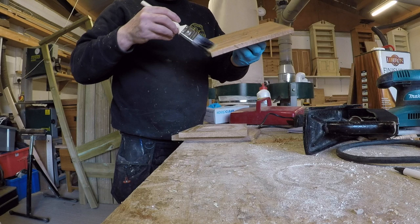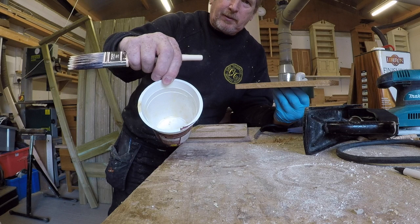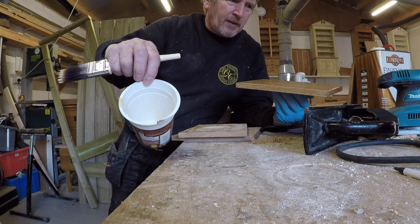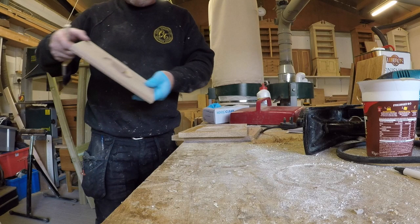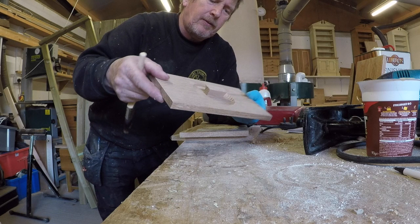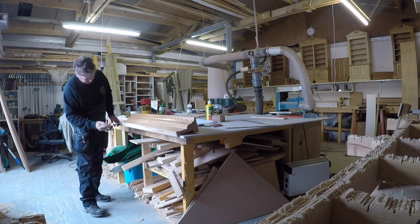This oil almost looks like it's on its last legs. It's congealed. Furniture oil goes like that, and when it starts to congeal like that, that is when it's at its best, because it's reduced to its potential ingredients, it's reduced to the activating stuff, it's no longer as fluid. It seems to be a wee bit thicker. The thing about oil is for a finish as well, I could have dust on there and what have you, whereas if it was a varnish, you'd have to make sure that it was almost squeaky clean.